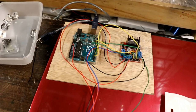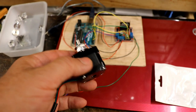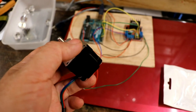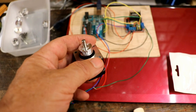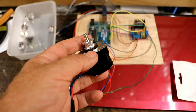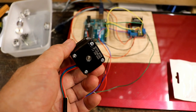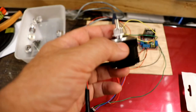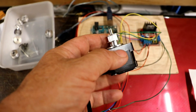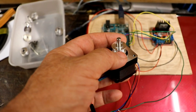I've worked out how to get the Arduino to control the stepper motor. I've heard back from Pimoroni about voltages — sure enough, you can use Ohm's law. The specs give current and resistance, and apparently you can multiply the stated operating voltage by between 10 and 24 times. The important thing is not to exceed the specified current for the windings. So I've ordered five proper stepper motor drivers — very small ones with a current-limiting variable resistor. I can adjust that to one amp, feed it with 12 volts, and it'll work as fast as it can.